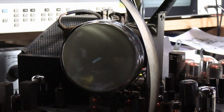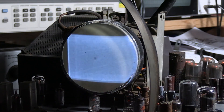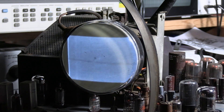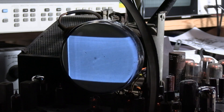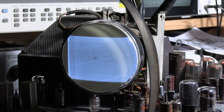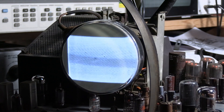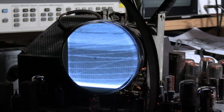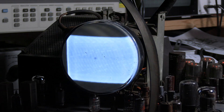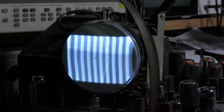Oh, this is four positions, not three. The bottom position checks battery life. I'll try it again. I'm not sure if it's the generator or the TV acting up — there are a ton of connections there. Tweaking the RF gain control... there it's back. I think maybe the switches on there are a little dirty.